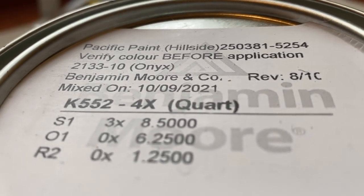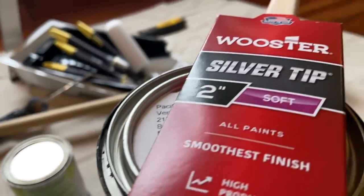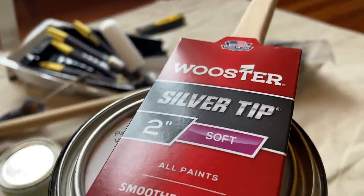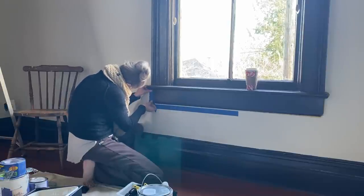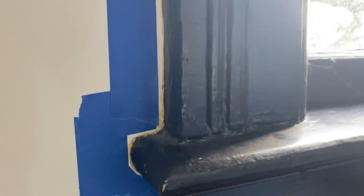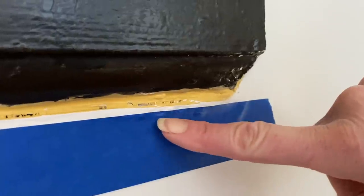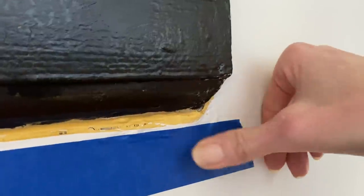For downstairs I really like the black contrast for trims, door frames, and doors. I used Athenian Black downstairs and found something very comparable — Onyx by Benjamin Moore. I'm going to use the ultra matte finish to cover up some of the imperfections of how old these frames, doorways, and moldings are. I'm going to make a little extension just a couple of centimeters outside the frame because it's so irregular from the plaster to the drywall, basically using the paint as a faux way of making the frame look a little bigger so I can create the straightest line.